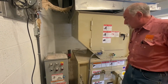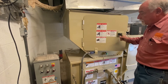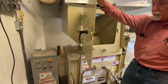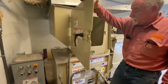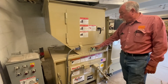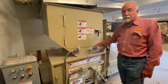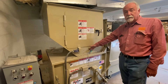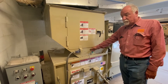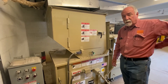Just want to go through some more of the safety features. On the machine there's a limit switch right here and this is on the loading door. When you open the loading door like this, the compactor will stop - just like it did with the stop button. No matter what position it's in it will stop. There's also a photo eye right here. When it's in auto circuit, this photo eye will start the compactor when it sees something going through the light. There's a delay of about 15 seconds when it's blocked - after it's first blocked, after 15 seconds it'll start the compactor and operate as long as everything is set properly for the auto feature to work.